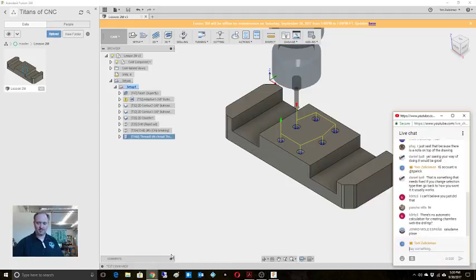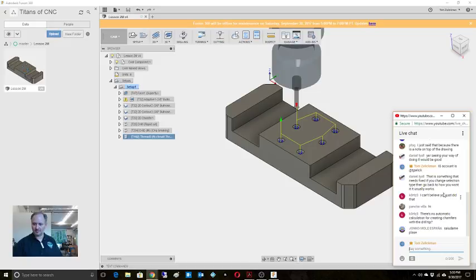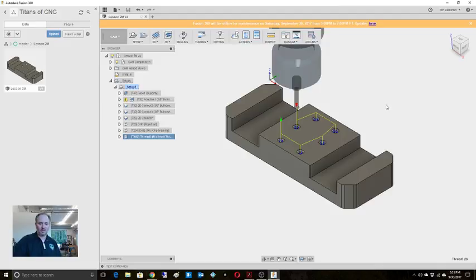And let me just check chat real quick. Hi everybody, there's no automatic calculation for creating chamfers with the drill tip. No, there's not, but again, with that 90 degree chamfer mill drill there, it makes it easy enough because the math on it is just half. So it's really pretty easy. And is that Yonko or Jonko? Jonko. Hello.